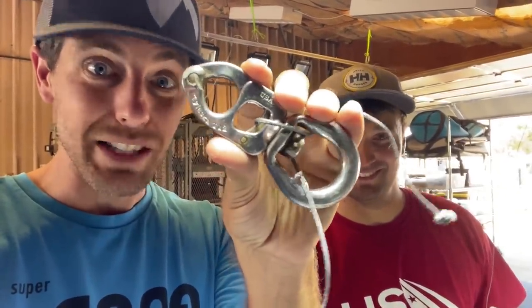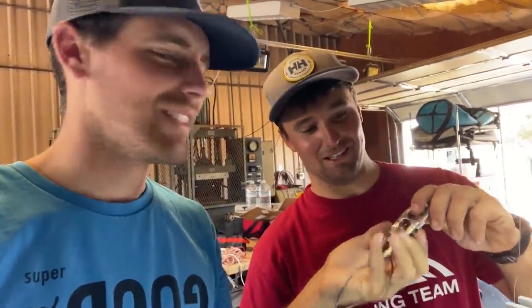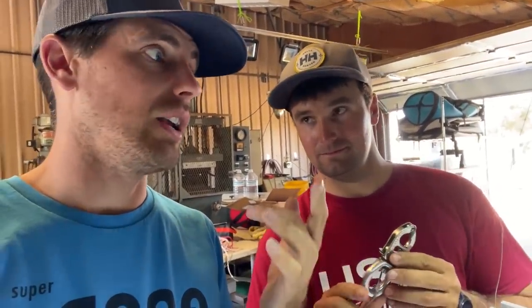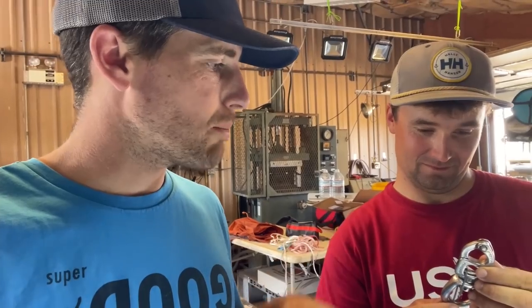As a bonus break test, we have a snap shackle. It's a high-load snap shackle — I have a small one I used in 'Shock Loading is a Myth,' but this is a bigger one rated to 12,000 pounds. The mechanism: there's a lever arm that catches and holds everything. It snaps closed, gets pulled under load, then you pull the lever arm and it opens up. We want to see if we can actually release the load under 5,000 pounds and then pull it until it breaks.